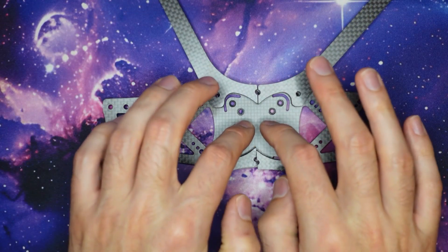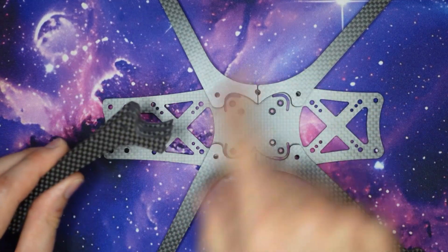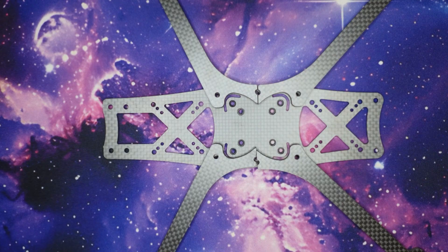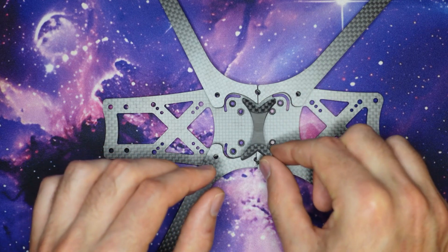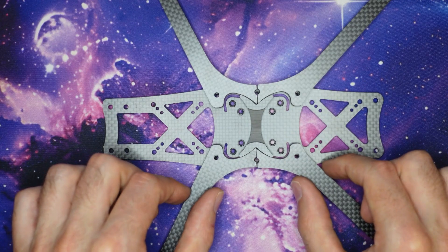If you're building the AOS 5 V 5.1 you've got four identical arms, so it doesn't matter what order you put them in — they're all going to be exactly the same. Once you have the arms in the correct position you're going to take the spine of the frame and, making sure the engraved part is facing upwards, drop that in between the arms just like that and it should just slot into place.